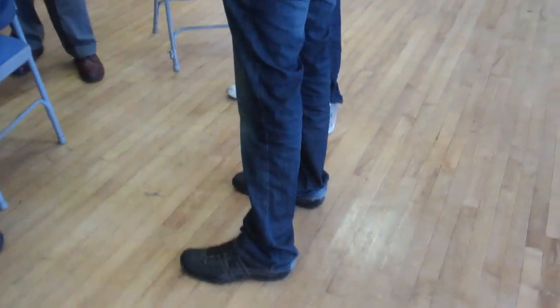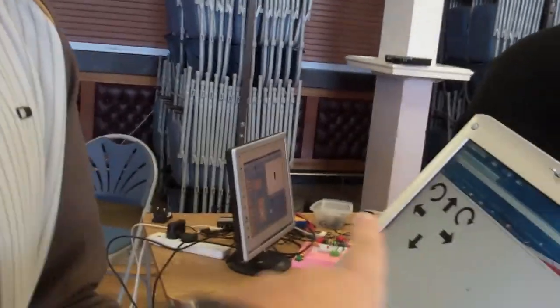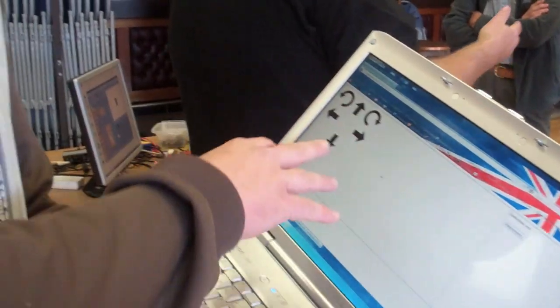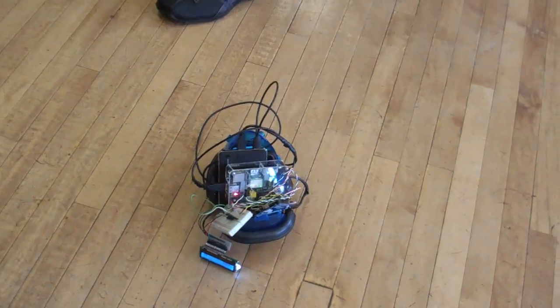You've got a number of technologies — motor control, hardware control, and the browser set up. On the Pi, you've got something listening on a port just to take these commands. The Pi generates the web page and serves it via HTTP. All you do is type in the address of the Pi, load it up, choose your instructions, and when you're ready, send — off it goes.